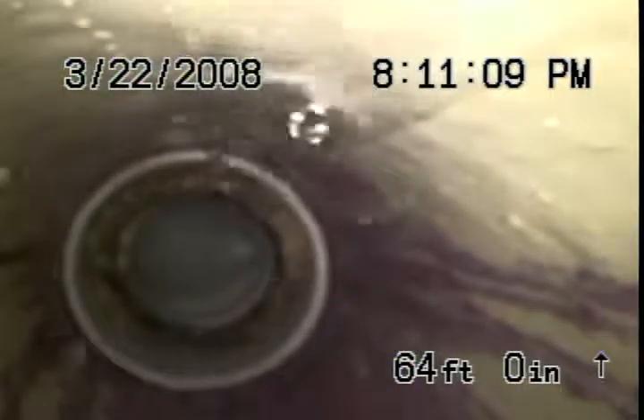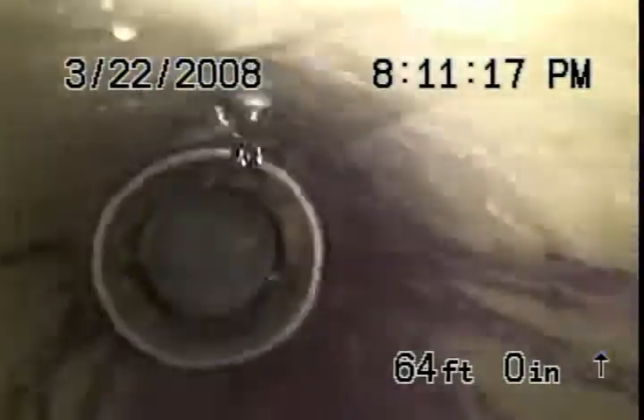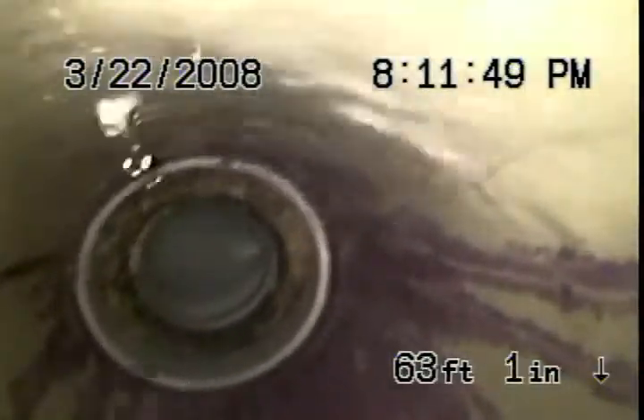The stream is just now hitting our two-way clean-out, 65 feet out in the yard. So this is our affected toilet flushing now. You can see a ton of residue here, all caked up, layered up on the walls, the sides of the pipe. Here's the Y we went up — we actually snaked past the blockage and went further up the line. We'll check the other toilets on ground level before we leave.